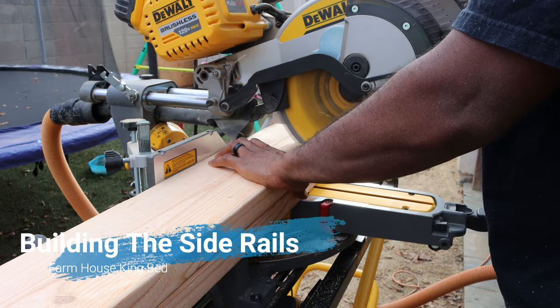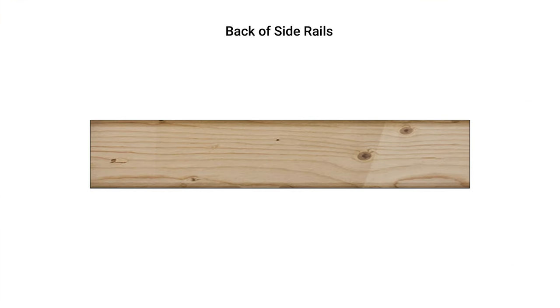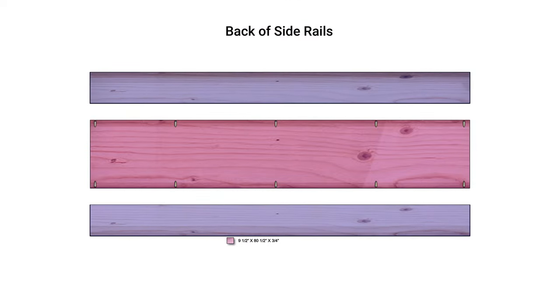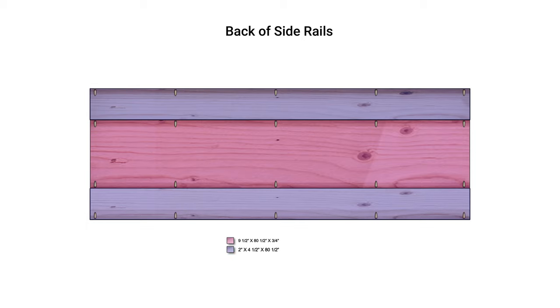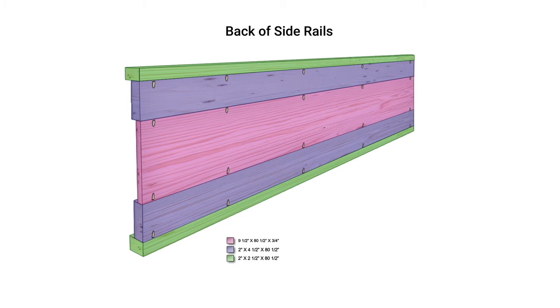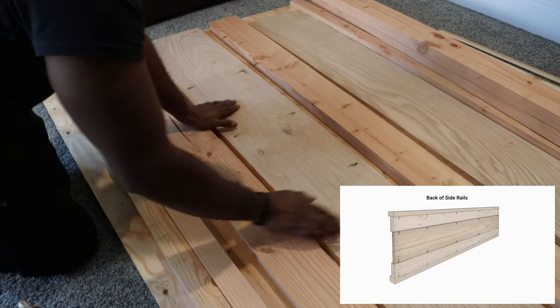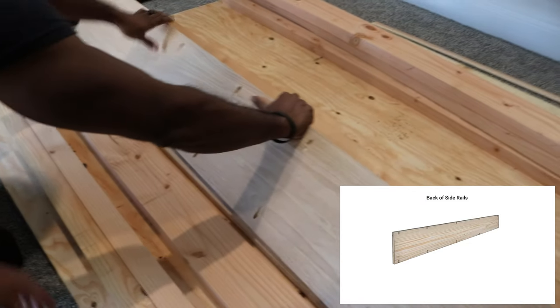On to the side rails — they were pretty straightforward. After cutting and ripping all my wood down to size, it was time to start assembling. We first put pocket hole screws at the top and bottom of our three quarters of an inch plywood, cut down to nine and a half by eighty and a half inches. We then took two two-by-six boards ripped down to two by four and a half inches, used the pocket holes on the plywood to attach these two boards, and also put pocket holes on the sides furthest from the plywood. These will connect our two-by-two and a half inch trim pieces. The goal, just like with the headboard, was to make the plywood look recessed, so I raised the center plywood piece three quarters of an inch before screwing everything together.